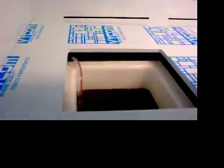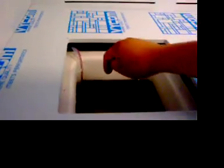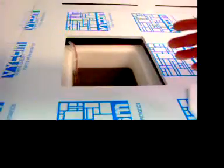We have two thermocouples. One is for the process. One is for the high limit. The liquid level tip needs to be at least 1.25 inches deep into the chemical to prevent failure of the liquid level sensor. If they got below that, how would the customer know that? They will have no alarm.